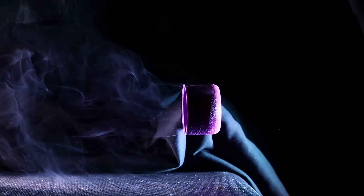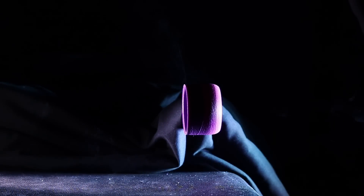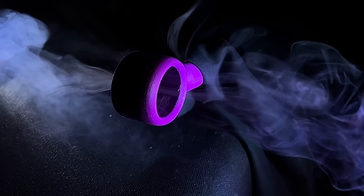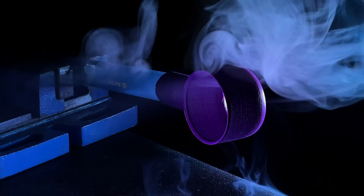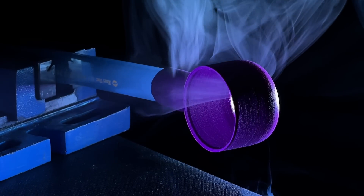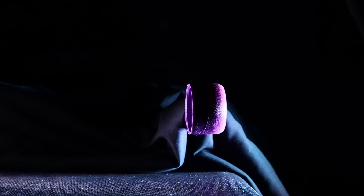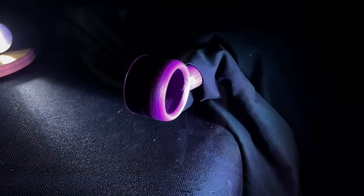I'm going to turn this on at low speed. At slow speed we can see that air is being pulled in nicely from behind, coming around the aerofoil shape and speeding up as well. Even at slow speed it seems to be working pretty well, though it's a little harder to tell that the smoke out front is being entrained into the flow. Switching to high speed, far less smoke gets around the hoop — nearly all of it is being pulled in from the back.